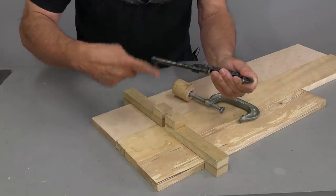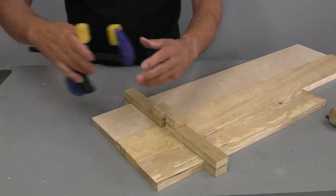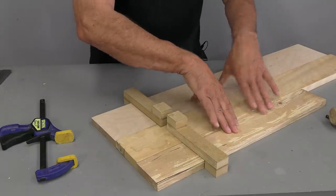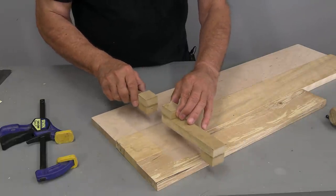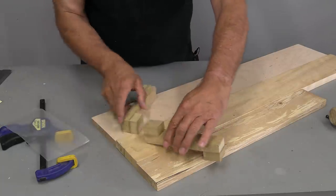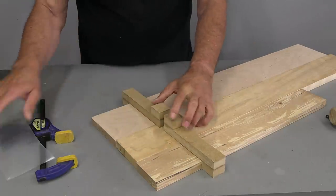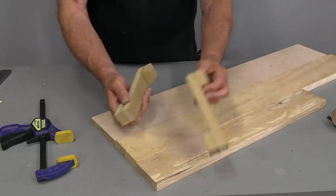This is a much better idea, although in some situations it's awkward, so it's nice to have both. But look, neither one of these fit here. You could use a one-handed clamp, but look at what happens — the wood flips up. So you'd have to have clamps on the underside and on the top. Just a really bad idea. One of the biggest problems I saw — and they didn't include this anywhere in the description — if you don't have something non-stick on there, your little extensions with a bit of squeeze-out are going to glue themselves to your project. Even when you take the clamps off, your extensions are stuck and you've got to chisel them off. The whole idea is just rife with problems.